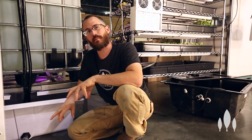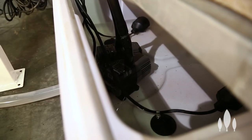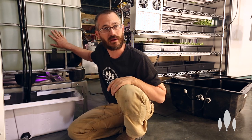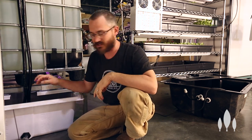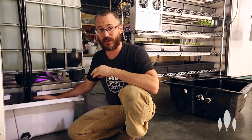This is a two pump sump system. When we say two pumps, we've got a pump in our sump tank — a low shallow sump here — and then we've got our main tank up here with our main pump in there. The main pump is doing most of the work, pushing a lot of water out under pressure to all of our zip racks. The sump pumps down here are just kicking water up to the top, so we can use relatively small, inexpensive pumps for our sump pumps.